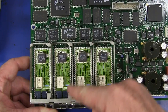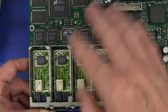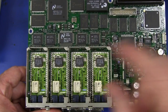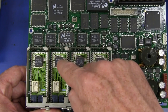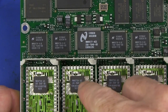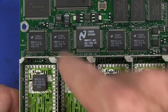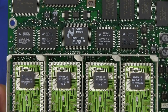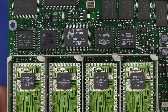There was nothing obvious of course. We've got a faulty channel 3 here, and we're not sure if it's in the hybrid, or whether it's in the ADC, or whether it's in part of the sample memory or something like that. But I asked for comments on the forum and sure enough I got them. It turns out somebody — Vincent, Free Electron on the forum — had the info that the hybrid amplifier chip actually has a high frequency and a low frequency differential driver output. So it splits the signal into high and low frequency components, and there are two differential pairs which go over to the ADC. That might explain it, because it looked like the low frequency content worked but the high frequency content didn't.